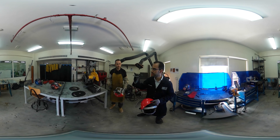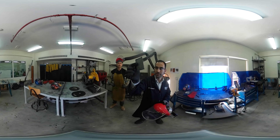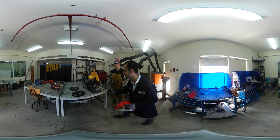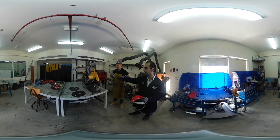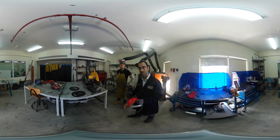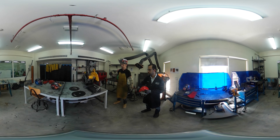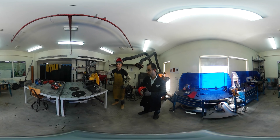This links back to the risk assessment point about sharp edges. Before we move forward, I have a quick question about pressure technique. Sometimes you see somebody barely grinding, taking forever, and other times the motor is really under load. There should be somewhere in between. Exactly — you don't want it too slow, you don't want it too fast. It is always safer to go slow rather than fast. If you are unsure, always go slower. Once you get more familiar, you'll get a feel for how much pressure to apply.